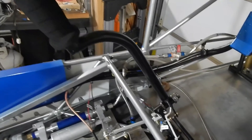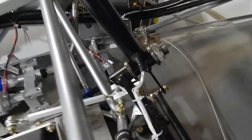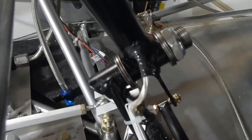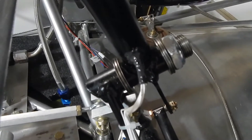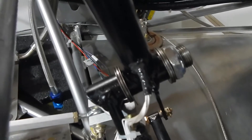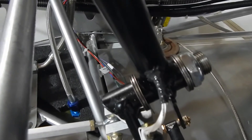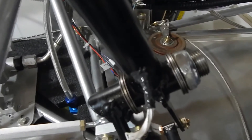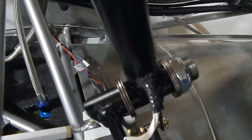Part of the work I'm doing is creating anti-chafing on the wires wherever I can. These are the wires coming out of the base of the control stick. A friend from EAA suggested putting heat shrink around them first, then pro-sealing it if you can't get a grommet in — which I couldn't. So I heat-shrinked it, put some pro seal all around it, and pushed it in underneath so it grabbed the stick.